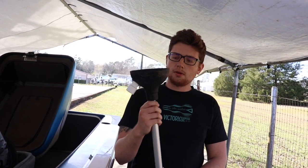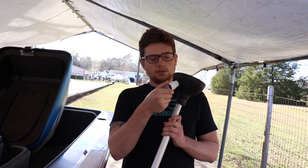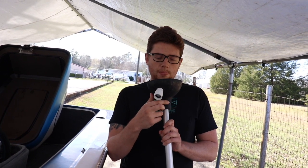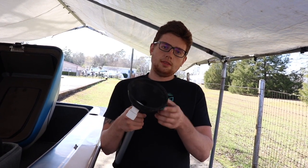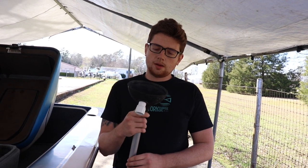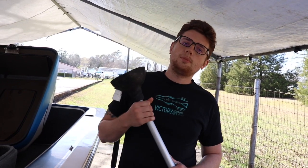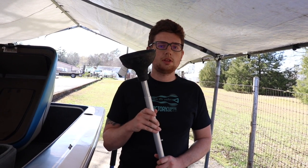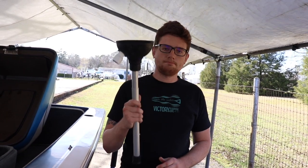Once we get that secured against the ground and the intake grate, we're going to hook up a water hose into this intake, twist on the water hose, and then turn the water on. This bowl will start filling up. The intake grate location varies on certain boats, but today we're working on an '84 Mastercraft Stars and Stripes with the PCM 6-liter ZR 409.